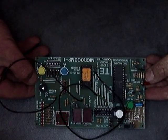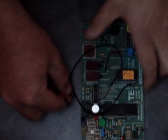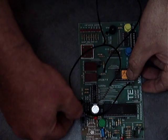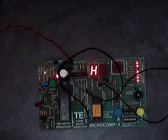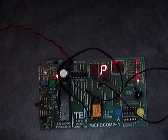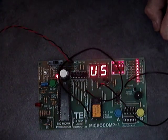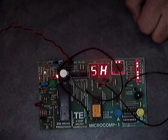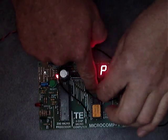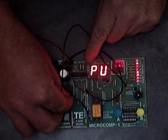There's another Talking Electronics computer that again has got some simple software in the ROM. It's got a few games and essentially just demonstrates different programming techniques to develop different outputs. Some inputs over here — simple DIP switches and a couple of push buttons and a speaker. You can use the speaker as a logic probe and connect it up to different points so you can hear the different signals around the computer.